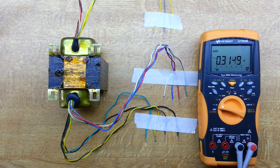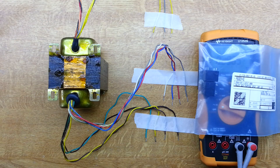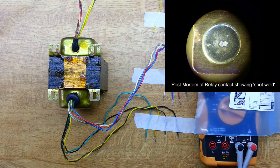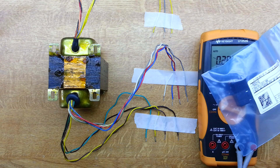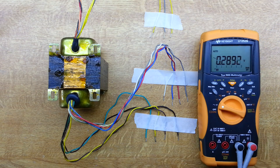We've got a record of these voltages before we do anything. This is obviously off-load, so the voltage might dip a bit once we've got the valves in place, but we're in a healthy place now. I've also got some replacement relays for the relay board. The contacts must have been welded when this problem arose originally, so we need to replace these. AudioPax advised that they've changed the supplier for these relays, so we've got the proper updated ones.